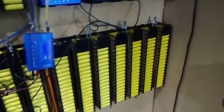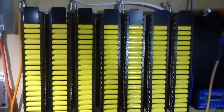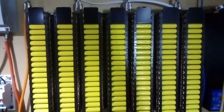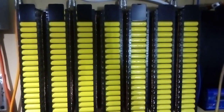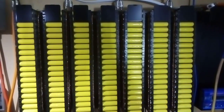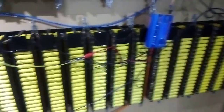I'm going to put these in service very soon because they're not connected to the system. I've just gone back to the original 4.7 kilowatt pack, which needs a bit of a balance — it's pretty far out now. I haven't done much to it and it's been in service about 10 months. I'll keep you updated, and probably in a couple of months I won't touch it unless something seriously goes out of balance.